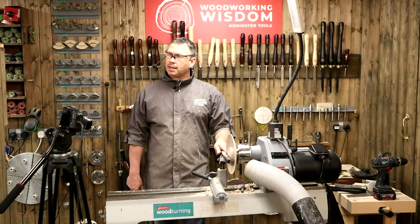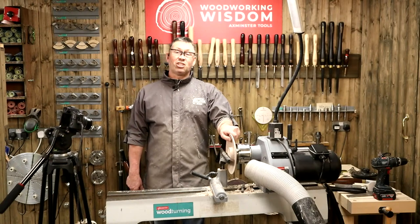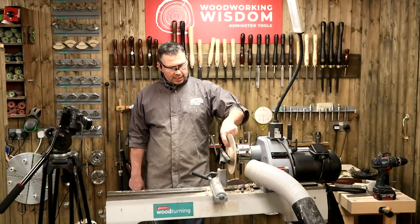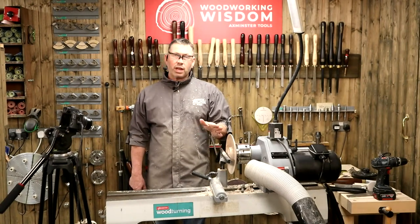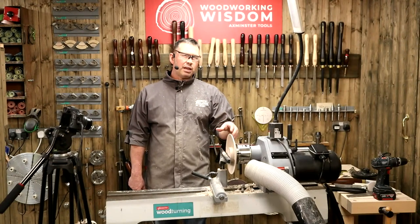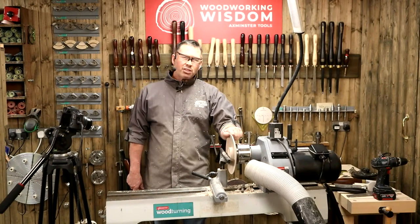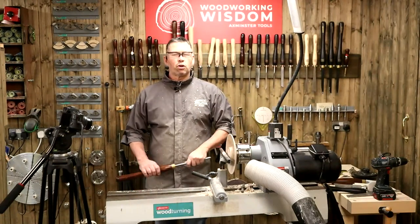And Cliff's asking, why go with the steps rather than a pull cut from the centre? Just speed and tidiness, really. I knew that I wanted to do this in stages here because of the vibration that it could cause. So that took that away nice and quickly. Because we're cutting the side grain, there wasn't as much likelihood of it breaking out as I came off the edge also. And it's just for me a bit quicker attacking that true side grain.